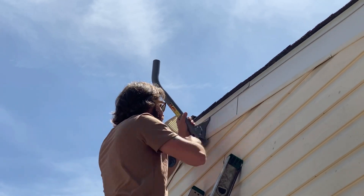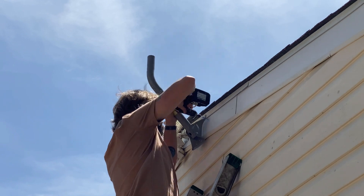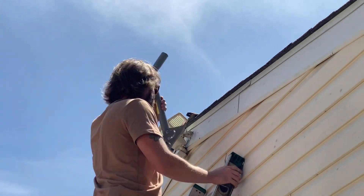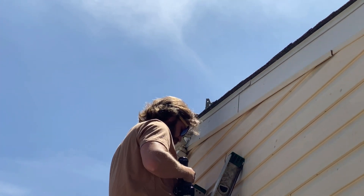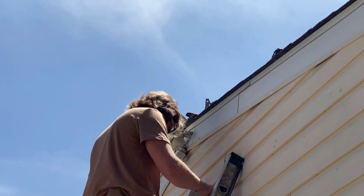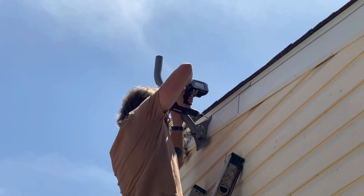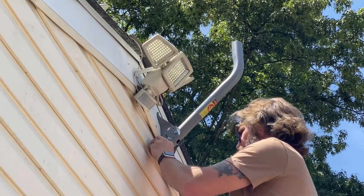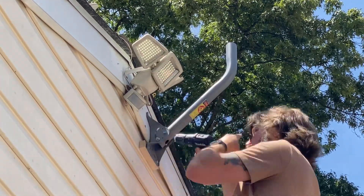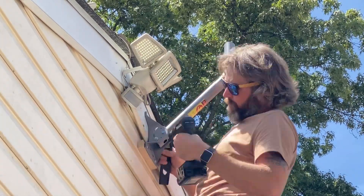There's a ridiculous number of deaths and debilitating injuries every year from people falling off ladders, and it doesn't have to be very high. Now that I'm an experienced weather station installer, a little pro tip for you: make sure that if you're not using self-tapping screws, you bring a drill bit up, get the pilot holes done so you're not fumbling around with the unit, and have everything handy so you're not sitting there fumbling around with parts in your pocket. They do say to try to get the unit to the highest point on the roof. The second story on our house would be a little bit occluded by a tree in the background, so I tried to get it to the highest point that would be away from everything else.